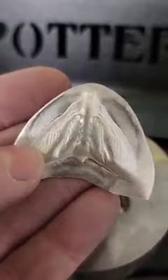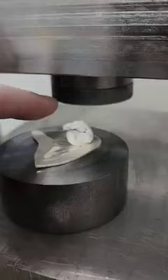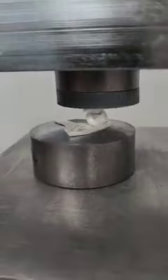I think I'm going to try it with some paper next time. This is a wadded up piece of paper towel — you could use packing paper or cardboard, it doesn't really matter. Just the same as when I use urethane, you want to make sure that the area you are working in is centered under the tool steel pusher in the press. We're going to try it again and press it one more time.